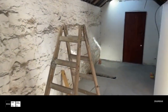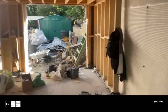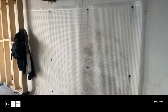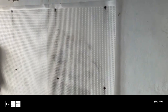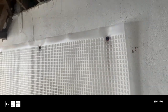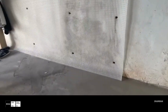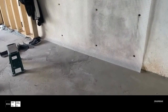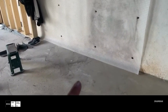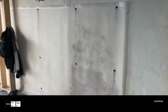So we've had to take a solution here of this plastic grating. You can see it here laid up against the wall. It's plastic with a sort of honeycomb in the back which lays up against the wall. This keeps the humidity in that zone and will drain it to a floor drain which will be installed on the floor. The floor will have a membrane attached to it that will connect on to this plastic grating.